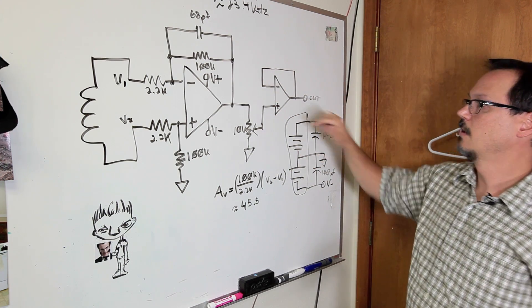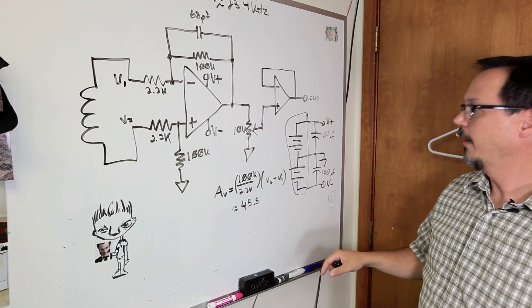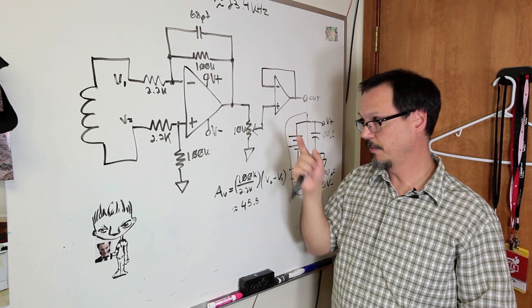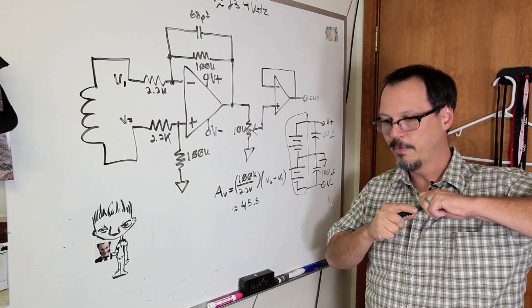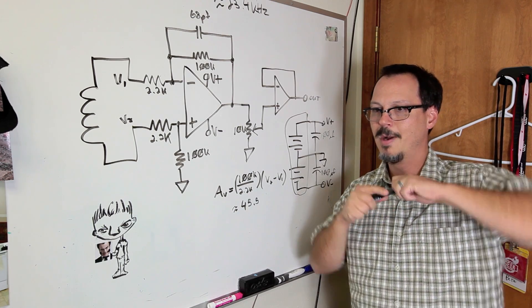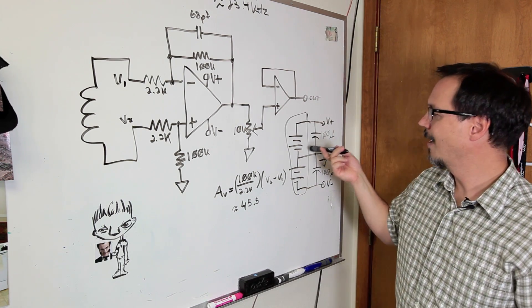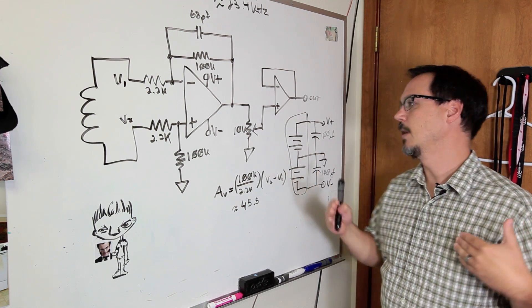This configuration goes straight to V-plus and V-minus. I don't even have a switch and it's working out pretty well. If you check the spec on the LM358 — which this is — it will go down to a bipolar supply of about ±1.5 volts. I'm running, when fully charged, at ±4.2 volts, so I'm well above where I need to be.